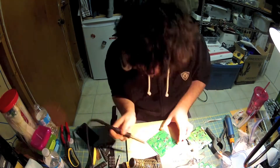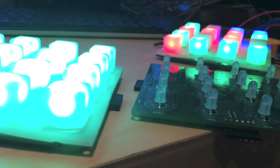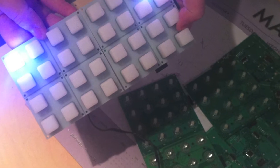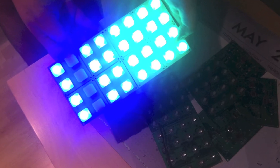As soon as I finished my first button pad, I was anxious to see if it worked. Using an AVR programmer, I burnt the button pad firmware to the microcontroller I just installed. As soon as the program was copied, the button pads came to life. Some of the modules had a row that didn't work. I rechecked all the connections and eventually all the LEDs were lit.